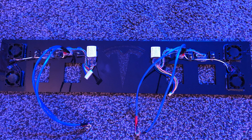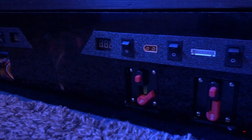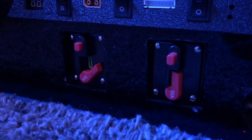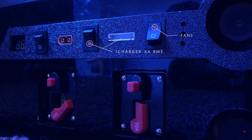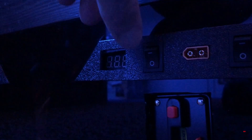Here is the fascia with all the wiring finally finished. One 50A fuse connects both modules together, and another switch turns on or off the solar controller and the inverter. One switch turns on the fans, and one switch turns on the JST plug for the iCharger X6. The other switch turns on the 6S voltage meter.